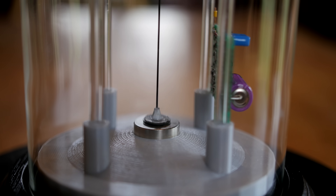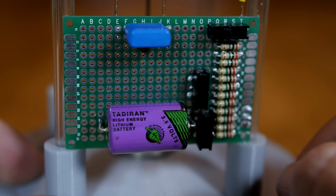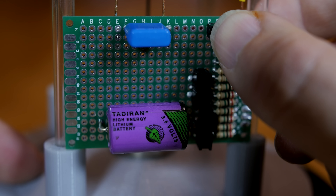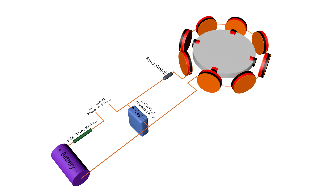I have 24 mega ohms worth of resistors in series, and I've got some switches that allow me to switch to different resistance levels so I can run the motor at different speeds — low, medium, and high. Here's a simple schematic for the motor showing where I'm taking my power measurements. I'm just an artist, no way an expert in this field, but I do enjoy experimenting, and maybe this graphic will help somebody else if they want to build one of these.